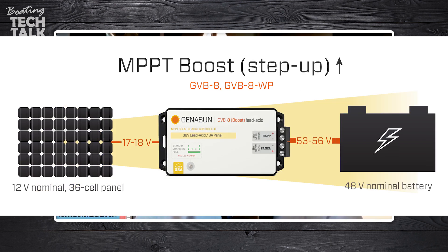Even if it was a 12-volt panel — 14, 14.4 — your battery might want 13.3. Maybe it's floating. Maybe your panel's 12 volts; you can't charge something to 12 volts, that's not enough. The battery needs at least 13.1 or 13.2 to flow charge. So regardless of what your panel voltage is outputting, it might not be what the battery wants. You've got two choices: a controller that brings the voltage down — we call those buck controllers. And often the name is completely omitted because most solar arrays are above the voltage of the battery bank, so effectively you will always bring the voltage down. It's rarely said — it's implied.